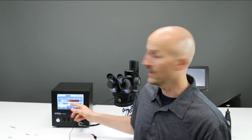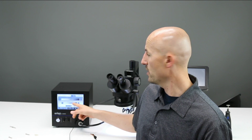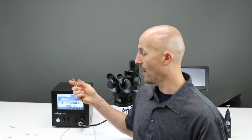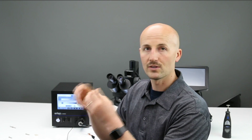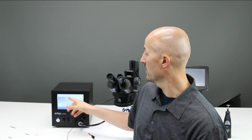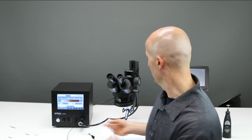These older systems had the same capabilities as the newer ones, including tack welding. On some 100Cs you had tack welding; on others you did not. On the 150S and all 150S machines you had tack welding. You ground two work pieces, touch them together, step on the foot pedal, and it does a light weld so you can check position. If it's not right, it comes apart easily. If it is, return to the arc screen, set your welding parameters, and do an arc weld.